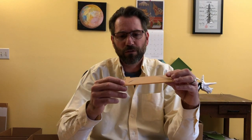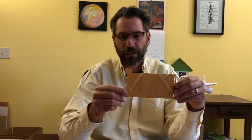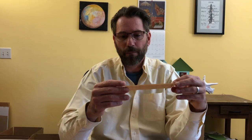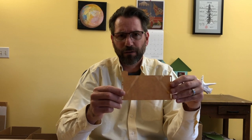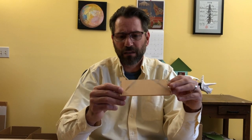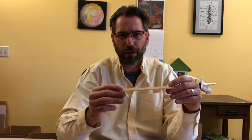If you're slightly under — 2.85 or 2.9 — that's great. If you're slightly over, like 3.12 or whatever, it might not actually fit in there. So aim for close to three millimeters or slightly under. If you're down around 2.7 it's going to be sloppy and not fit right, so try to find yourself a thicker piece.